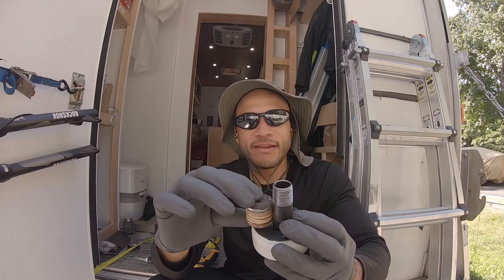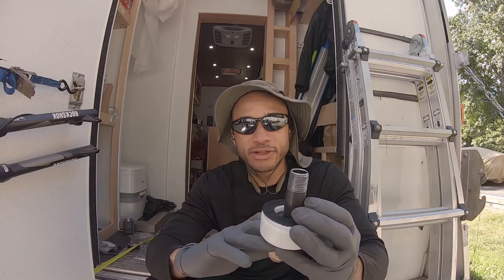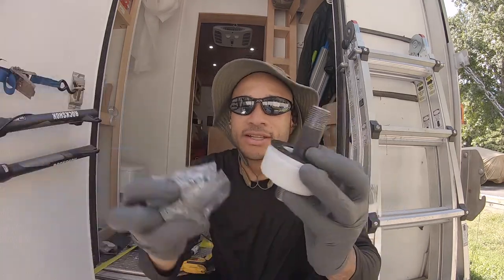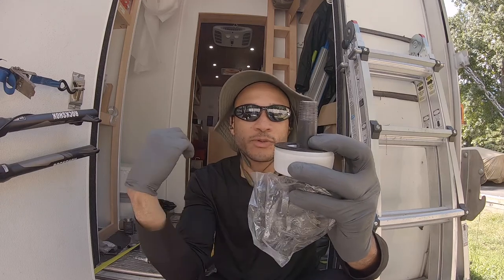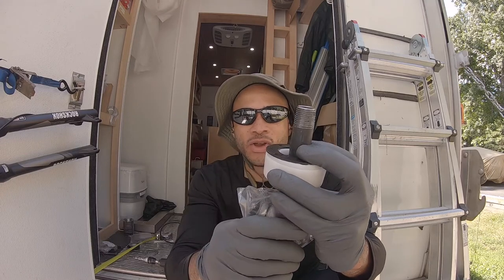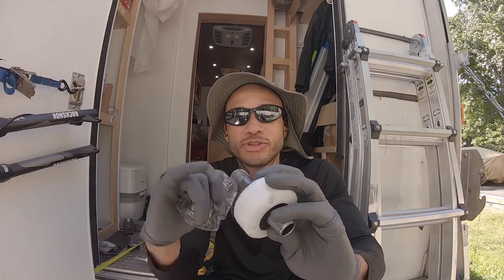So the only difficulty that I will have is actually getting the shutoff on there, because you need either two people, one person at the bottom holding this together, because this is gonna be like that. This is our drip leg. Having a pipe wrench or a crescent around that, somewhere snugged, and then I have to do my shut off on top. You just have to make sure this keeps from spinning. So that's going to be a challenge if you can't find anybody mechanically inclined enough to hold this and tighten it, to understand what you're trying to do.